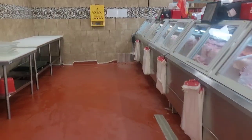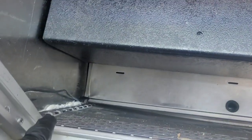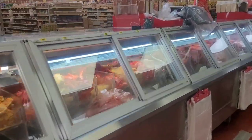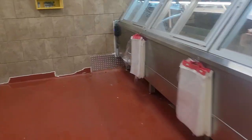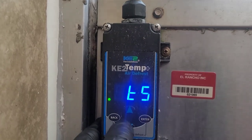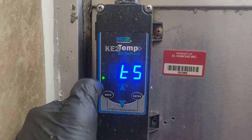Here's the only catch — my temperature sensor was up here on this coil that I just bypassed. So I moved it down and stuck it inside the pipe coming up here so it can hang out. It's set for 20 degrees. I'm going to keep an eye on it while I charge it up with refrigerant. It's measuring 36 right there and reading 34 over here, so it's pretty close. I don't think I want it to go down to 20, so I'm going to set it to 26. You've got to push and hold the button until it goes back to the display value for it to take on the KE2, in case you didn't know. And that's it, guys — thanks for watching the video.